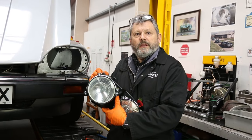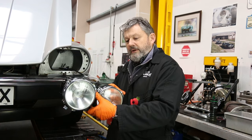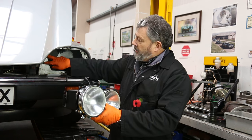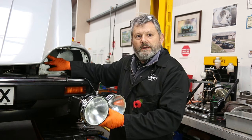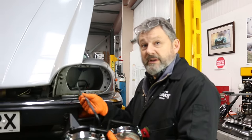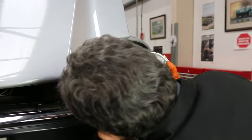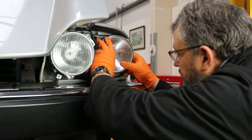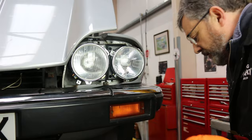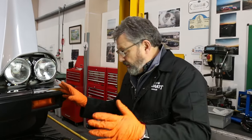We're ready to mount this. I've put two screws already on the back plate so it'll just slot in and give us a leg up when we come to align it. These are quite difficult to get to so you do need a long Phillips screwdriver. There's plenty of space behind the lamp for all the cabling so you can just tuck it in. That's in the hole — I'm now going to put the screws back in to hold it in place.